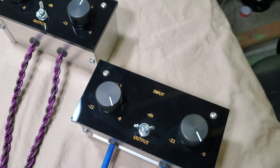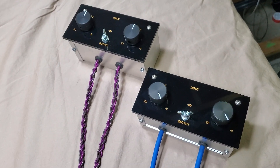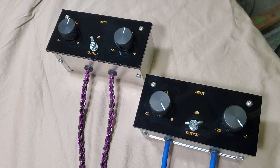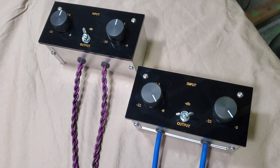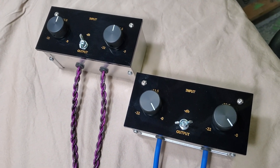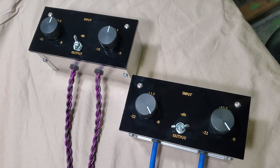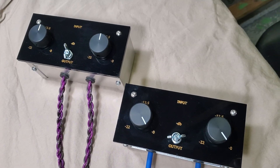You can adjust it based on the gain of your amplifier. Most amplifiers nowadays have a power amp gain of 25 dB to 35 dB. My own amp is actually lower gain at 21.5 dB, so for that purpose you don't necessarily have to use it. But there are occasions where even customers using my amp and preamp — because they use high-efficiency speakers or the DA converter output is too high — do need attenuation. You can go back to my signal-to-noise ratio video for what the ideal gain range for a power amp is.